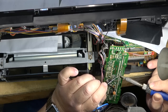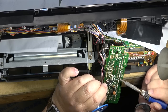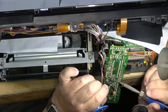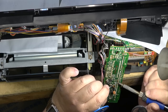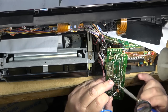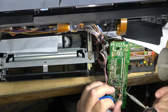But this is not a Super VHS that I would be preserving myself. There are many other ones that JVC made that were a better machine with fewer parts. These ones had a lot of components in them. And discrete components, although some people might think that's better because you can change the individual part, which is true, you can, but it doesn't make it more reliable. It actually decreases the reliability. Large-scale integration was a big improvement as far as the reliability of all these devices went.